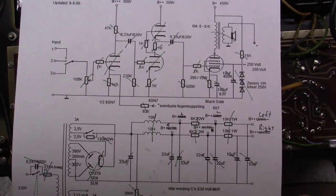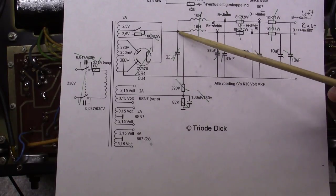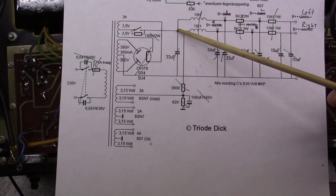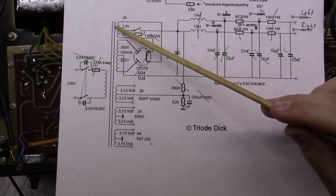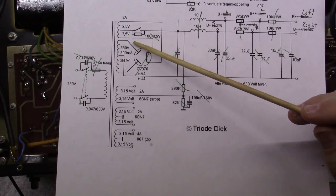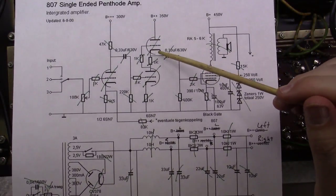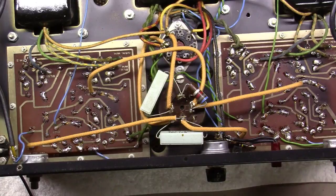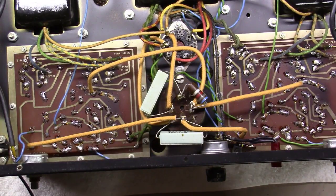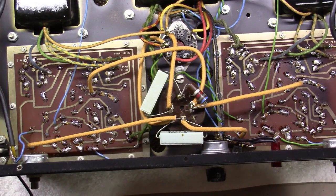Looking at this schematic, you're coming off pins 2 and 8 of the 5R4 or 5U4, over to a point where you'd have about 400 volts being rectified with a 33 microfarad capacitor. At the same time, pins 2 and 8 are also tied back to the connection that feeds 5 volts AC to heat the filaments — because this is a directly heated cathode, unlike the 6SN7 where cathode and heater are physically and electrically separated. Hope you learned something. You can always think of it as the DC offsetting the AC either positively or negatively from ground — it's all about your reference point. Thanks for watching everybody.